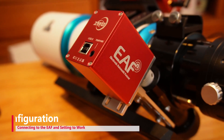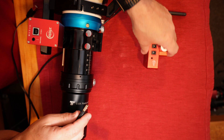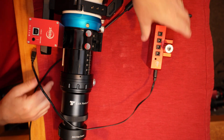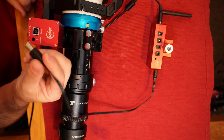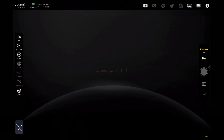Now you're ready to connect the EAF and find initial focus. I highly recommend you do this in the daytime to save frustration in the darkness. The latest EAF uses a single 5-volt USB cable to connect to the ASI Air. Older 12-volt versions will need a 12-volt connection as well. You can power the 12-volt versions from a DC port on the ASI Air if required. Fire up the ASI Air and then the app, and plug in the EAF. It can go into a USB 2 port on the ASI Air, or you can plug it into the USB hub on an ASI Air Pro model.